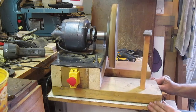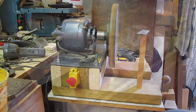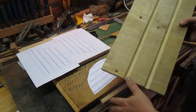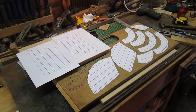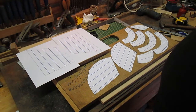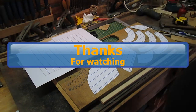And that will still move around. I'm going to cut the trunnions for the pivoting table, which I actually used a bit of the old table saw because it's got the runners in it — so that will work and I'll make good use of that. I'm going to cut all these bits out and that will make the trunnions. I've got to stick them down, cut them out to rough shape, and then I've got the lines I can cut them out to. Hopefully everything will go together.